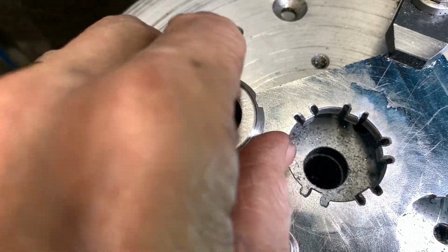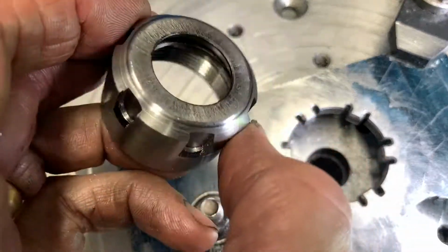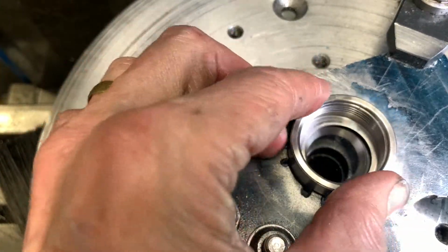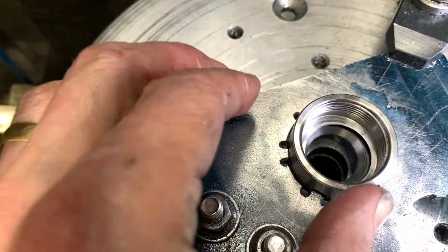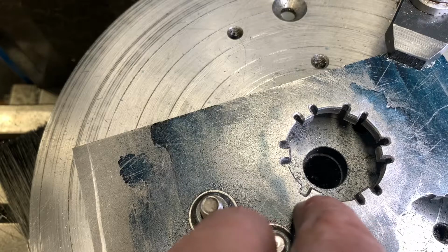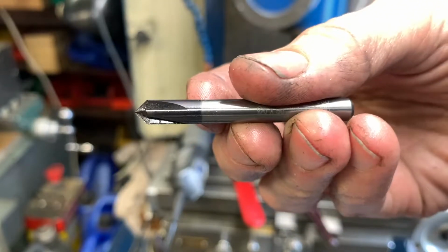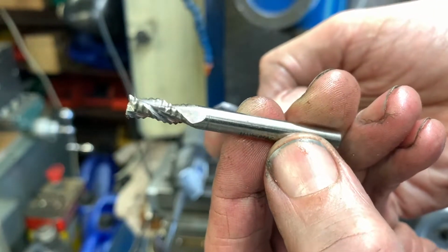Rightio. Okay, so I think my cutter was flexing a little bit as I went in to do the teeth. So, you know, when I dialed in to take 1/1000th, it sort of didn't quite do that. We've run the chamfer tool round the outside, round the edges. And there you go. Nice tight nut. So now what we'll do is we'll cut the outline of the spanner with a ripper cutter. Cutting the relief here made all the difference. Okay, so that was the tool I did the chamfering with, my chamfer tool, and that's going to be my ripper cutter.